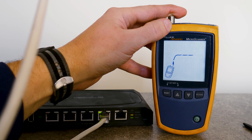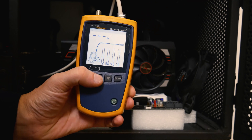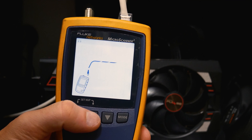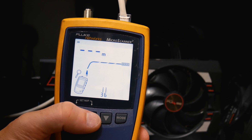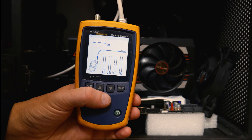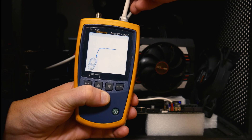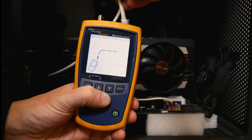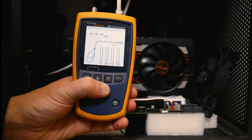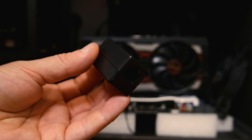I will try another test with a live Ethernet cable. This cable goes to an inline coupler and then straight to the router. Right now it's showing me the link speed and trying to figure out the cable length — again about 10 meters. If I wiggle the cable I can show that I'm losing link, which is a good thing to know. It's probably losing connection in the inline coupler rather than the RJ45 connection itself. This live link function lets you test live link breakage, which is really useful.